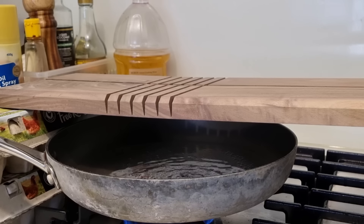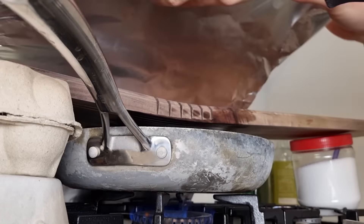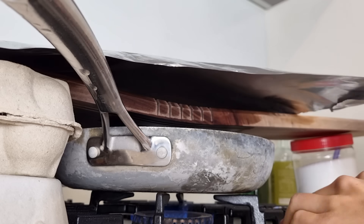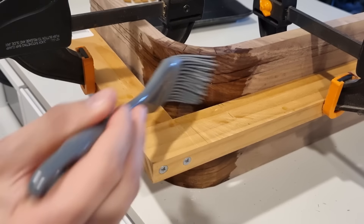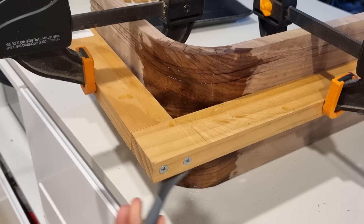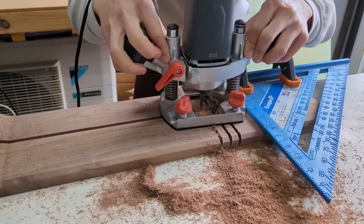And we're back to the kitchen to give this wood a good steam. I made sure to let the wood get really soft and even brush the surface with hot water to prevent the surface from cracking. These steps were repeated for the other bend.